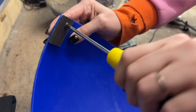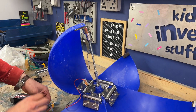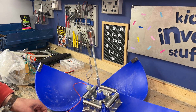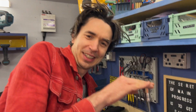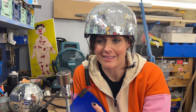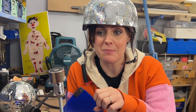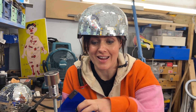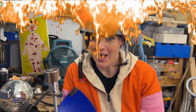What could possibly go wrong? Test one of the electromagnets — it's sticking. Let's disconnect it. Oh, that's really hot! Would you like a disco ball where fire rains on your head because the confetti has caught fire? When an electromagnet is powered, it can get quite hot, and this one is getting very hot. We're worried because we'd have to keep it powered up a lot of the time to keep the disco ball closed. That could get hotter and hotter, and anything inside the ball could potentially catch on fire — and that could rain down on top of your head. That's not what we want.